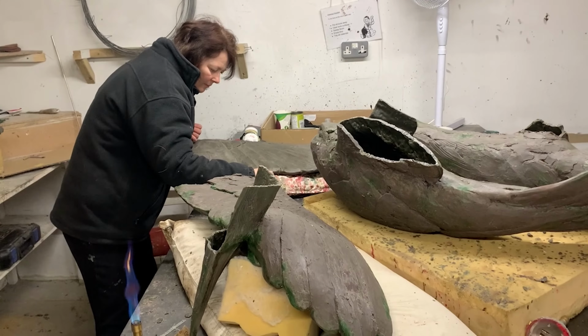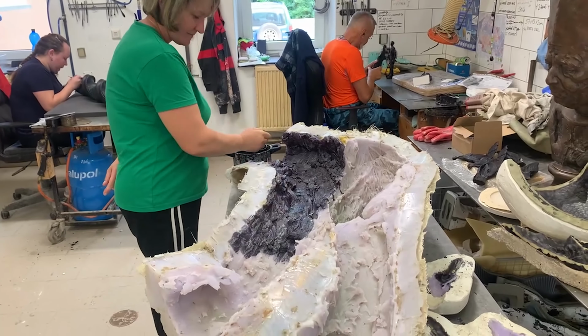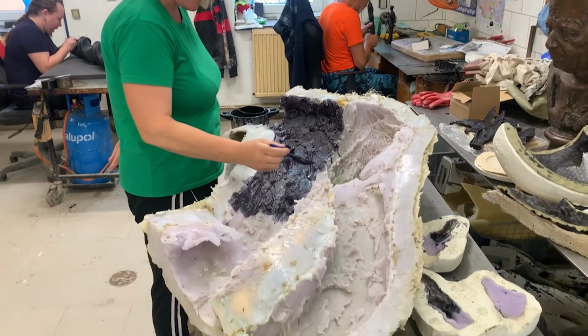The rubber moulds then go to the bronze foundry, where they go through the next stage, which is having a positive wax cast taken from the moulds. The wax is painted into the moulds, and it's quite thin. It's the thickness that the final bronze cast is going to be. They also put some tubes of wax onto the rubber called runners, and later, when it's being cast into the bronze, this is how the liquid molten bronze pours to the extremities before it cools.